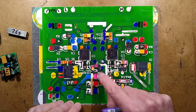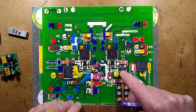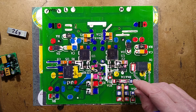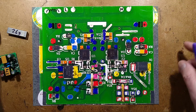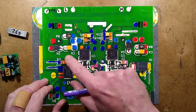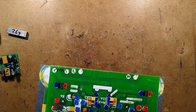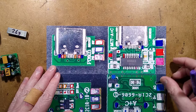The two opto-isolators are important, as are the 431s - these are little voltage regulators controlled from vertical stacking modules, which are quite odd. It's these ten tiny little modules here. There's also a snubber network to the power supply and feedback circuitry with an opto-isolator. It's one of the most extraordinarily simple little chips I've come across - it must be a rip-off of another chip.